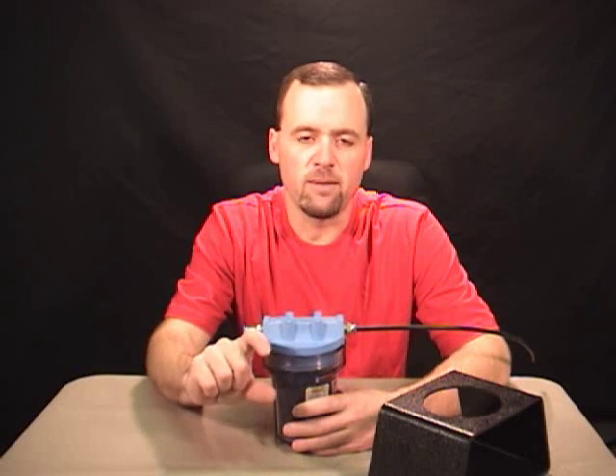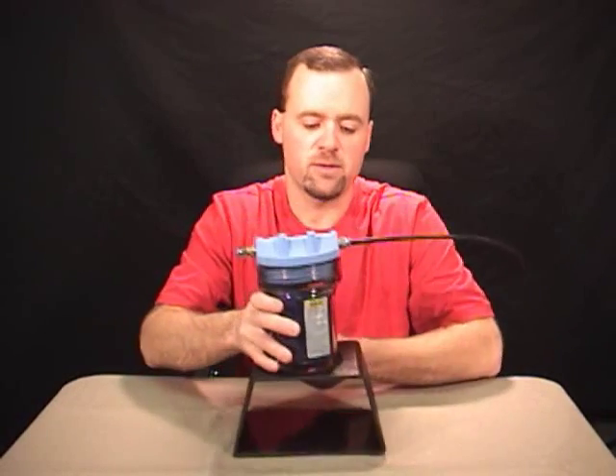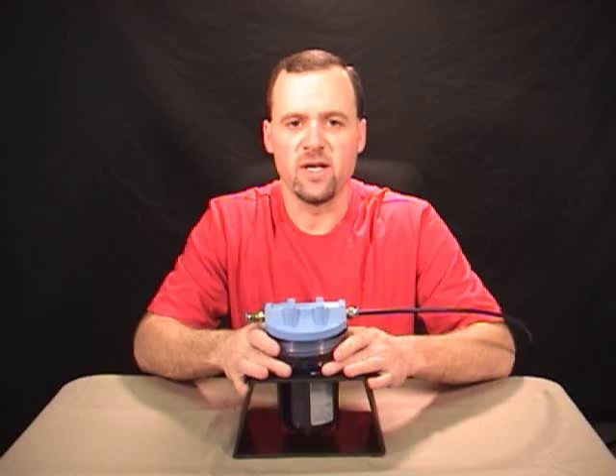So if you're having any moisture problems with your regulator or you're getting water in the bowl of the regulator, a desiccant filter is the best way we've found to prevent that. If you're getting your sand clogging and your blaster clogging up, this again is the best way to prevent moisture from getting downstream. It's real easy and adapts to either of the systems very easily.